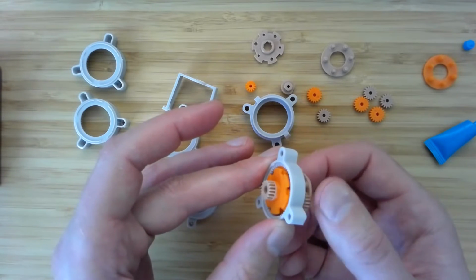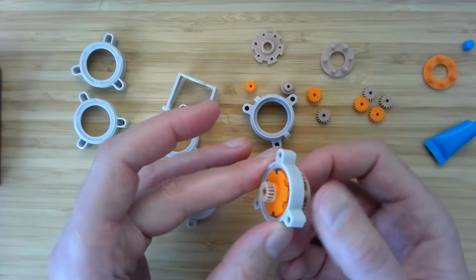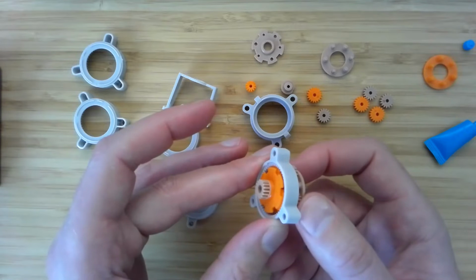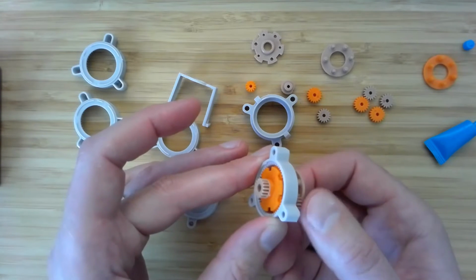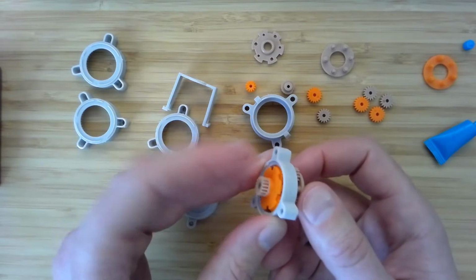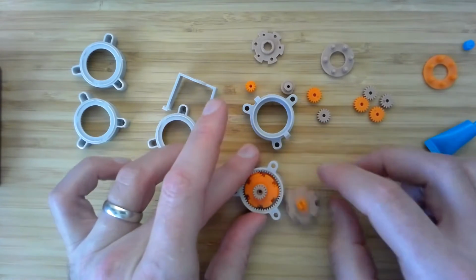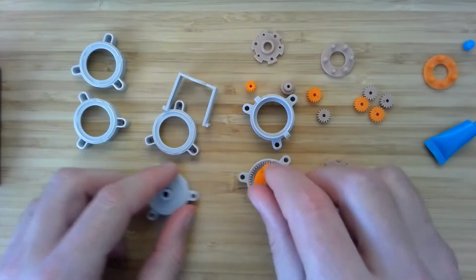And the speed ratio is the inverse of the ideal torque ratio. So if we count carefully, we'll see that I have to rotate the brown cage 4 times for every 1 time that the orange cage goes around. It's 5 times. And so the torque is 5 times higher coming out of the cage. Ideally, of course, there's some loss due to friction. And that's something we'll be wanting to characterize in our tests.